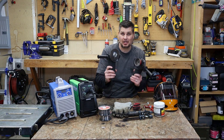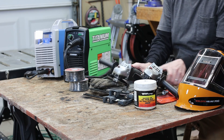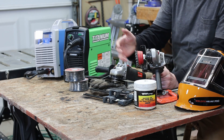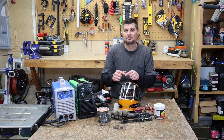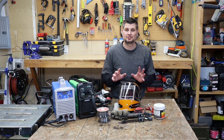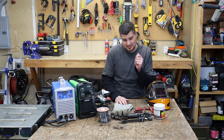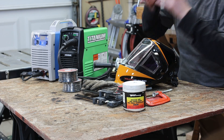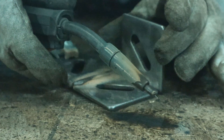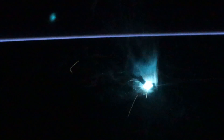While you're at Harbor Freight, pick up a couple of angle grinders — they're cheap and a lot better than using a hacksaw. Pick up a pack of cutoff discs and a wire brush. Last but not least, an auto-darkening helmet. Most machines come with just those little face masks — trust me, you don't want that. If you're starting out and having a hard time welding, that's probably one of the reasons. These helmets let you see what you're about to weld, and once you start welding, within a fraction of a second they auto-darken so you can continue to see your weld.